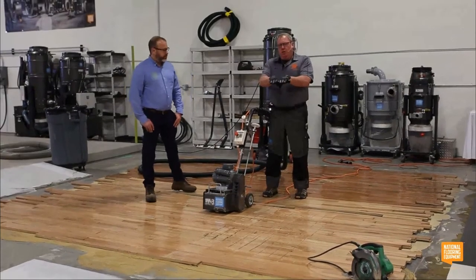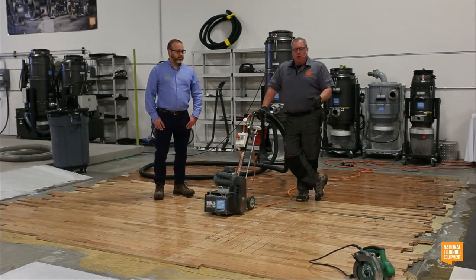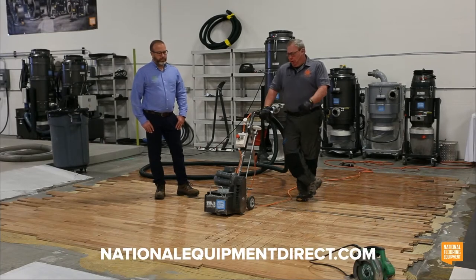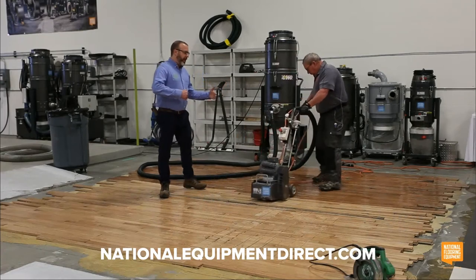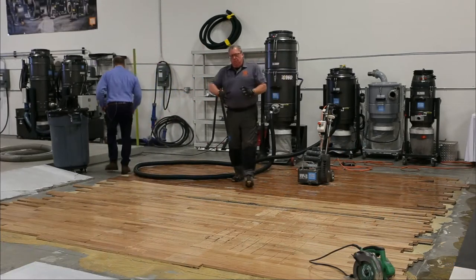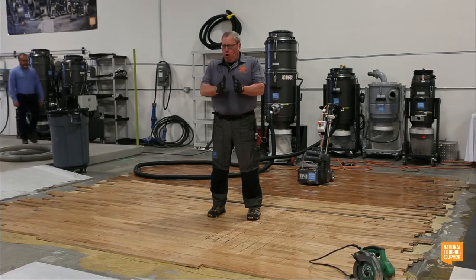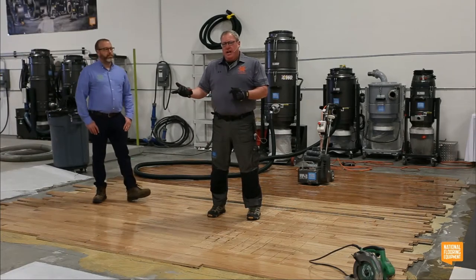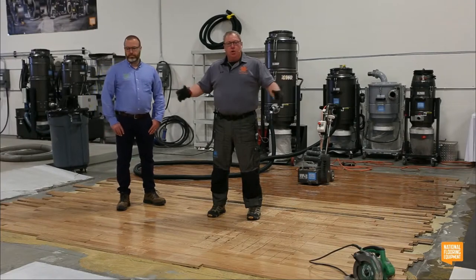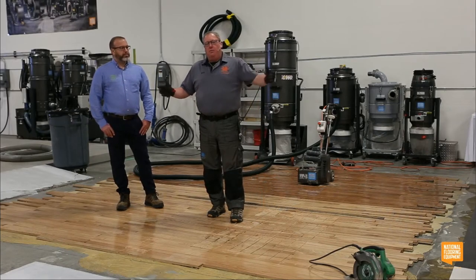The wood floor is tongue and groove — it's all pushed together. So even with the biggest rider, if you're trying to take up the entire floor, it almost becomes a monolithic floor. Scoring it helps it break up, makes the wood pile in front of you, and makes cleanup a lot faster. Step one: score your hardwood flooring. When would you recommend cross-cutting closer together versus farther apart? For a walk-behind scraper with a wood floor blade, cut them closer together because it's a tough removal. For larger riders like the 8000, you can put one or two blades and cut about four to six feet apart. The bigger the machine, the farther apart your scoring sections can be.